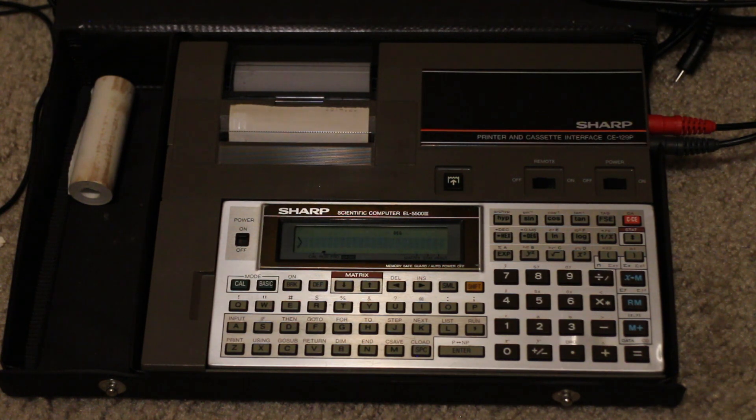And there's our program — twenty-seven seconds of audio. What you heard was a first tone — I'm pretty sure it's either four or two kilohertz. I think it's two and four kilohertz: eight cycles at four kilohertz as a zero, and four cycles at two kilohertz as a one, or something similar to that.